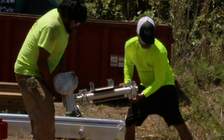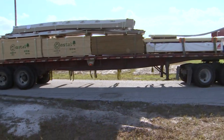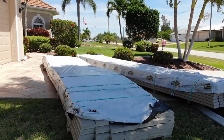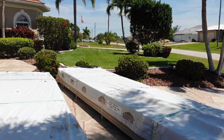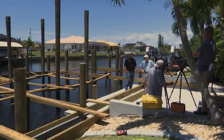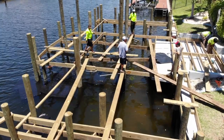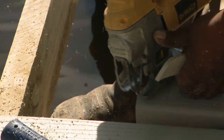What did he go with decking-wise? Because it's not typical — it's not wood. He's going with something really high-end. Yeah, so he's got an all-composite two-by-six Lumber Rock synthetic decking. And that's primarily what we're going to be concentrating on today. It's really going to be a great show. How many square feet are we looking at? About 960 square feet, John. Let's finish up the headers, put in some stringers, and learn a bit more about this Lumber Rock that everybody is raving about.